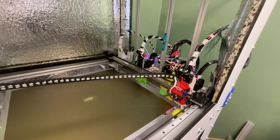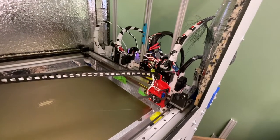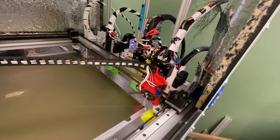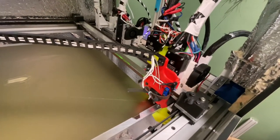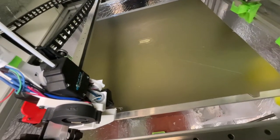Now it waits for the temperature to go up from 180 to 220 degrees. I have installed an E3D Revo Beta unit in that tool, so it heats up fast. Now it's purging 10 millimeters and wiping on the silicone. There is the silicone wiper. And that's the tool.